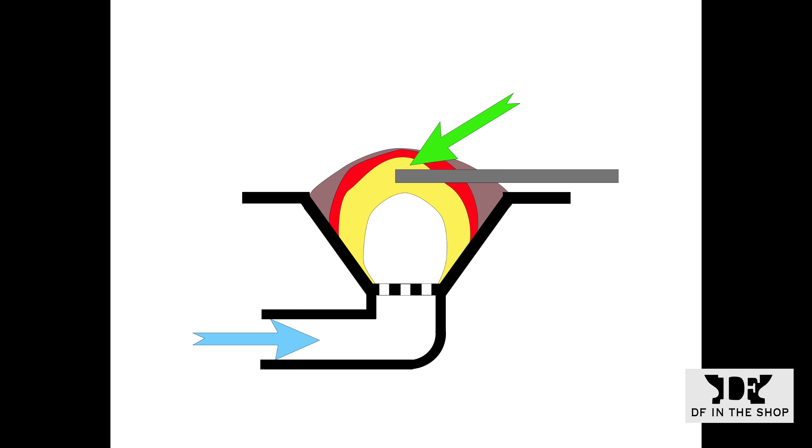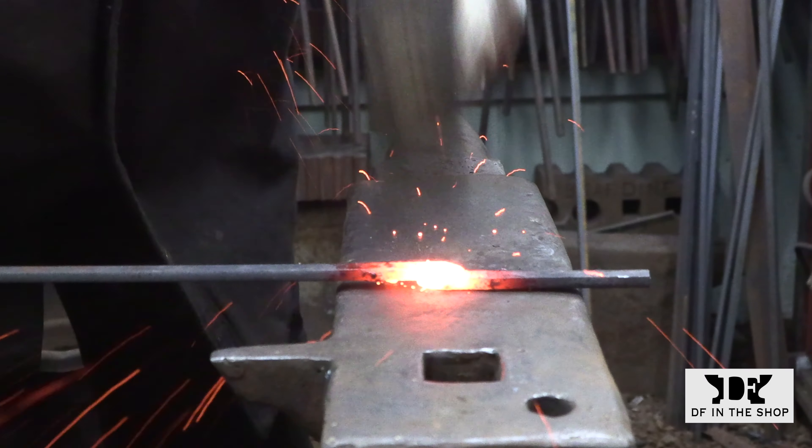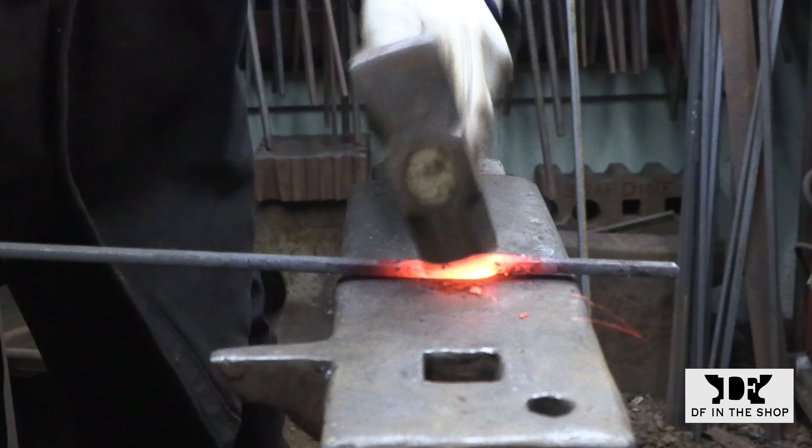In this next sample I've let the height of the fire drop down quite a bit. It's still above the edges of the fire pot so it's probably deeper than most people try to use for forge welding, but you can see how the neutral zone has really diminished in size. Even though technically it's still there, it's so close to the oxidation zone that it's being contaminated from the extra oxygen running through the fire. If this fire looks familiar to you, it's probably the reason you're only getting welds to stick about 20 or 30 percent of the time at best. The border between the oxidation zone and the neutral zone is just too close and it's probably always moving — if the oxidation zone drops a little bit you'll get welds to stick, and if it moves up a little bit nothing's going to work for you.